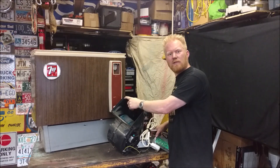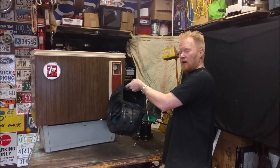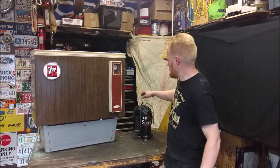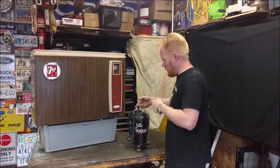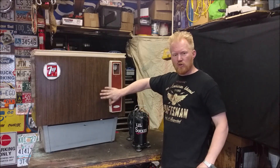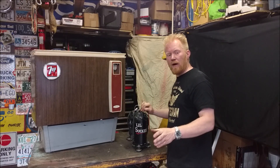Welcome to my shop ladies and gentlemen. Today we're going to take a reclaimed pile of junk that used to be an AC unit and turn it into this - what I'm calling the little sucker. This is a vacuum pump. We can vacuum down AC systems in cars, homes, refrigerators, or even in vacuum chambers and blow some stuff up.